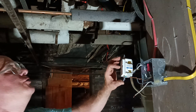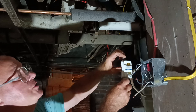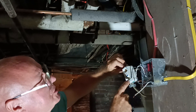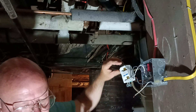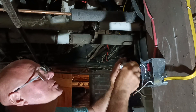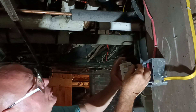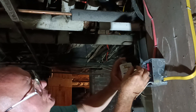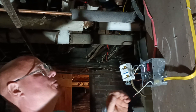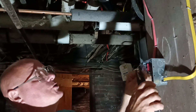I just shut off the three new breakers that are in there to make sure it's off. When you look at the back of your GFI it will say line and it will say load. Now this is going out to the garage as our load. So what I'm going to do is take my wire, hold it up to the back of our device and check our strip — I can make that slightly longer so we get a nice clip under the pressure plate.